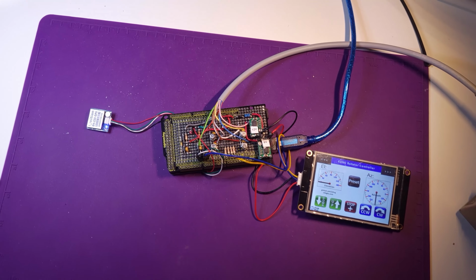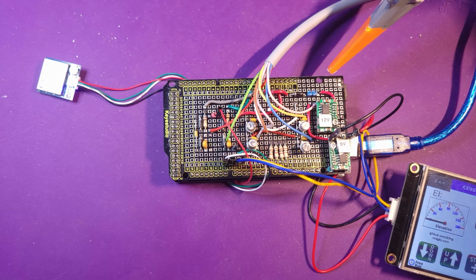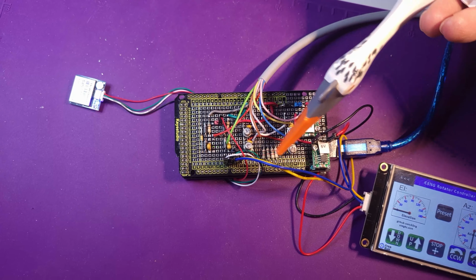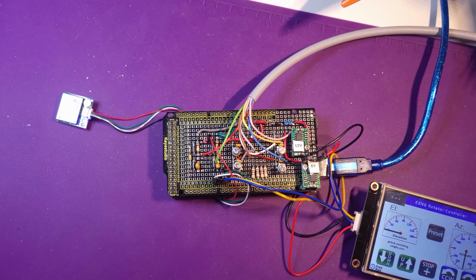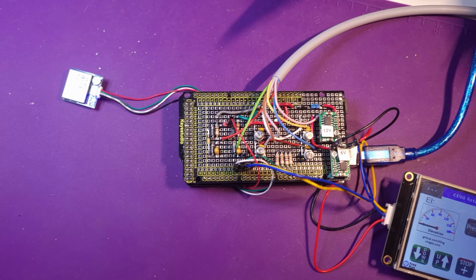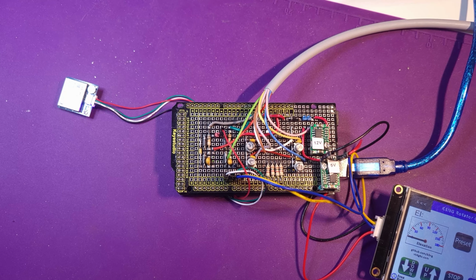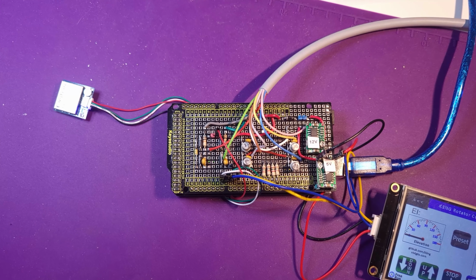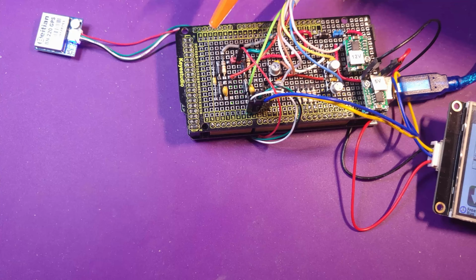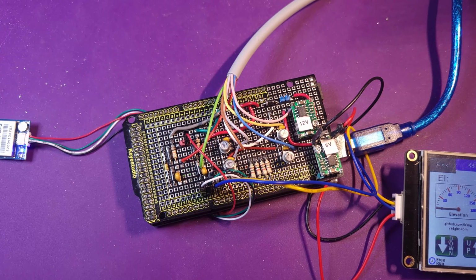Taking a closer look, the circuit is actually simpler than it first appears. Everything's been assembled on a proto shield board, which is plugged into our Arduino. At the core of this controller, we have these four transistors. These are connected to digital outputs from the Arduino, and they control relays inside the Yaesu box. We also have two 0 to 5 volt signals from the rotors that are giving us position feedback. This board pretty closely follows the K3NG schematic. There are some resistors and capacitors I've also added, and some diodes. These are all just for protection of the Arduino.